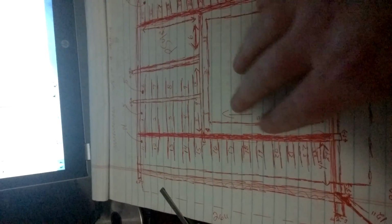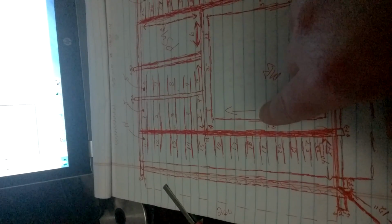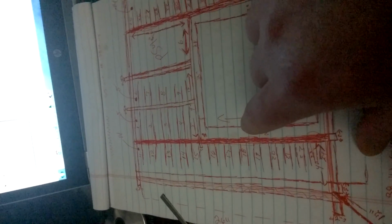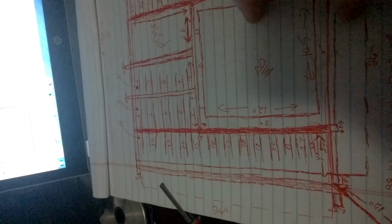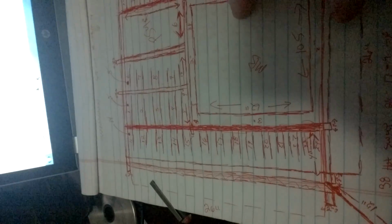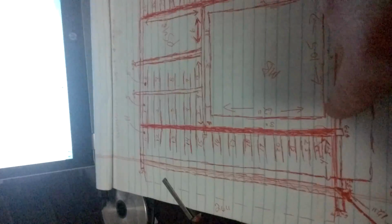So the way this one is set up, it actually has 10 USB 3 connectors as part of just the regular connectors on the side of the board. Then you have another on the right hand side here. You would have another 2 USB 3 headers, which will power another 2 ports apiece. And then that's only 14, and we've got 38. So then we've got to get into the expensive stuff.